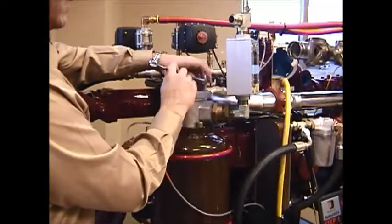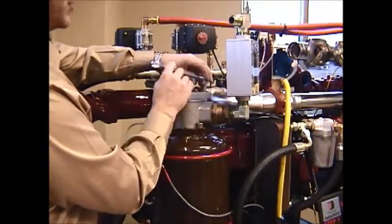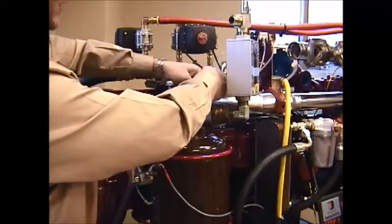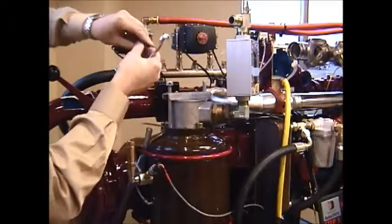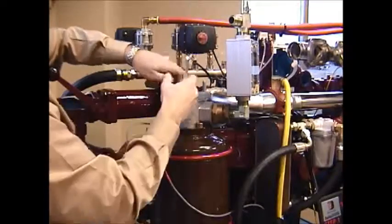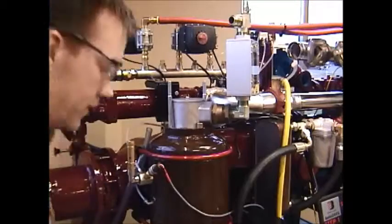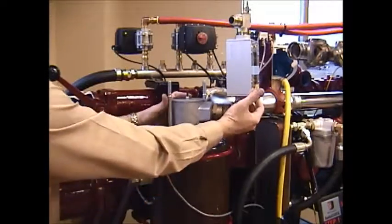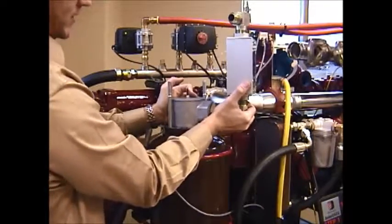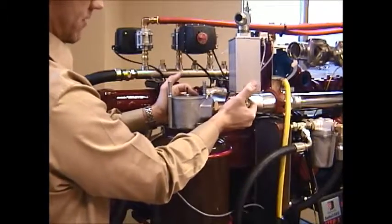Again, we're removing the Nylock nuts and the washers that hold the discharge head into place. Loosen up the nuts, take them off these stud stems, set them aside. And you can remove the bar that holds the discharge head on. Grab it firmly, and you'll want to give it a little bit of a jostle side to side. This entire head sits inside of the oil reservoir,